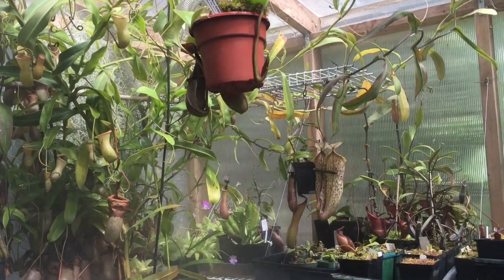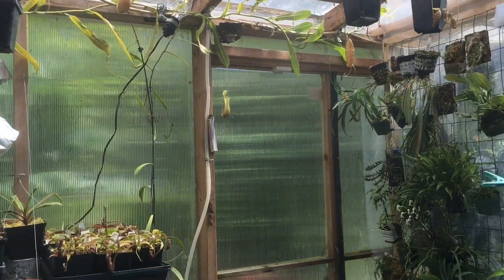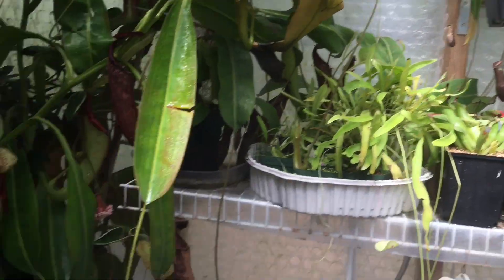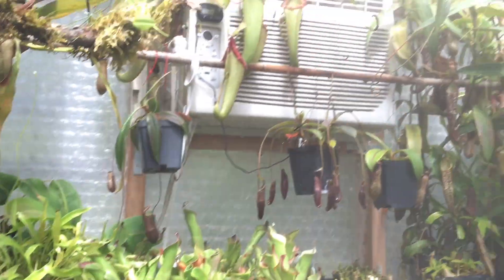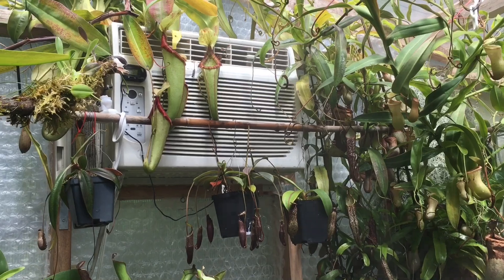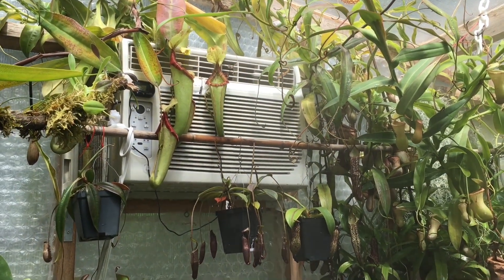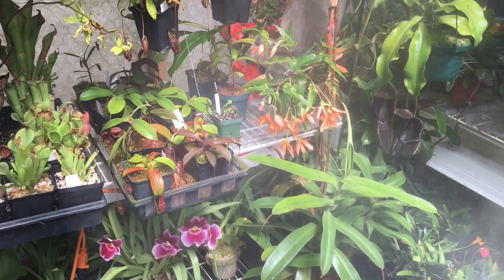The misting is off again. I did trigger the switch to run a couple extra minutes just to show it during the video. The temperature is now down to 27.3°C and the air conditioner is working hard today because it's really hot outside, but it will eventually catch up, then turn off, and the temperature will rise about two degrees before it kicks back on. On days that aren't bright and sunny, it doesn't run for long — it just holds a nice exact temperature, which works great.